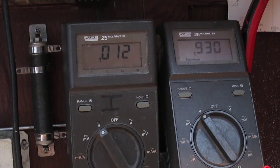Now the base voltage is the important one. Let's make sure the base voltage is right. It should be minus 40. Oops, minus 42. Okay, it's not far off. Minus 44. Importantly, I need to make sure that the base voltage of the PNP transistor is at or about 0. It is 0.1. Far out, because in the past that's been at minus 25 volts. And we should have on the emitter, on the PNP, 0.6. Okay, that's good. That's about right. 0.7.